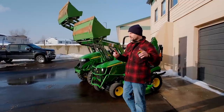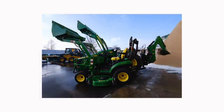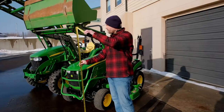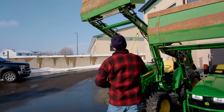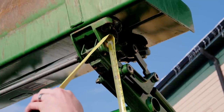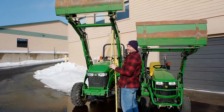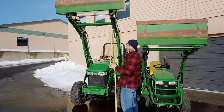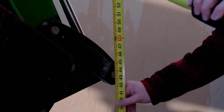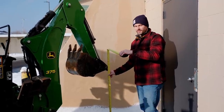Okay, it's been an hour — 60 minutes. Let's grab some measurements and see how they compare. This one started out at 69 inches and we're now at 68 and a half inches. Now the H165 loader on the John Deere 4105 tractor — 102 inches, maybe 102 and an eighth at the most. We started at 102 and a half, so it moved just a fraction of an inch. Let's check the backhoe — we're at 43 and a half inches; we started at 45. So the backhoe dropped about an inch and a half, the most out of all three. I find that pretty interesting.